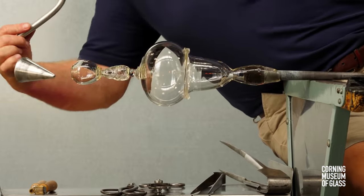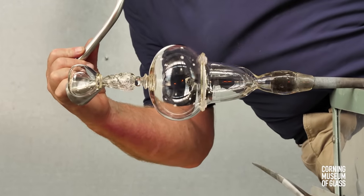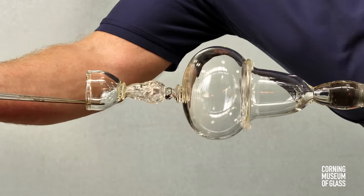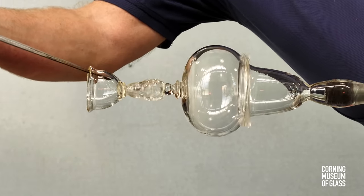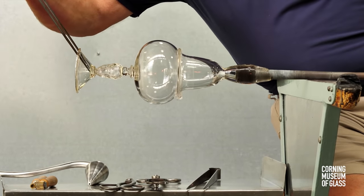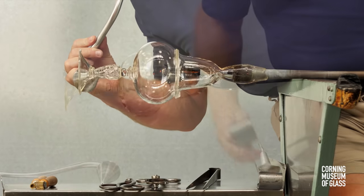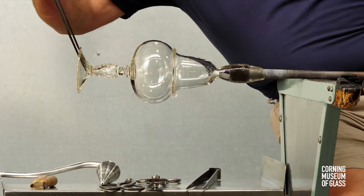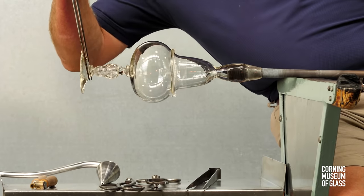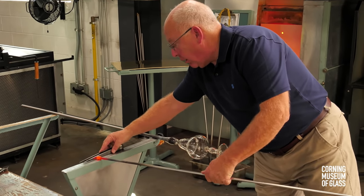During this reheat, the stem unavoidably softens. The vessel foot has a folded edge — a double thickness — and this is created by pushing the edge in slightly. The dilation begins and it creates a double thickness, which is both attractive and makes the vessel edge much thicker. The foot is given its final shape, it's straightened, and after flashing the entire piece in the furnace, the punty, or pontil, is added — a teeny bit of glass put on the end of a metal rod, the tip blown to cool it slightly, and the neck broken.